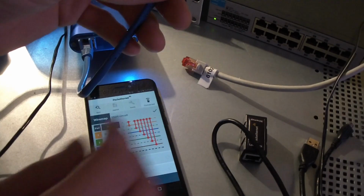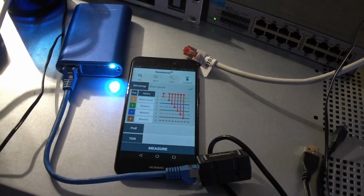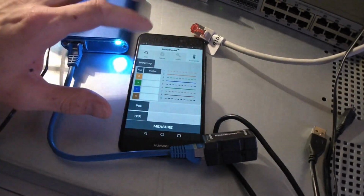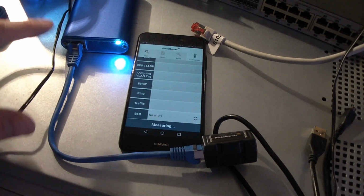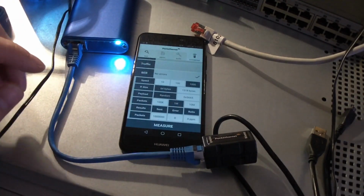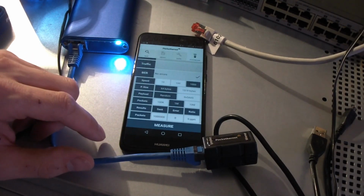I tested like 3 cables. Well then, let's come to this little gadget here. That's a loopback adapter, and with that you can test network cables themselves. So unselect that, and we're going to go to the other tests in a second. This tests basically bam, bam, bam, bam, back and forth, and you can see what kind of rates your cable supports.